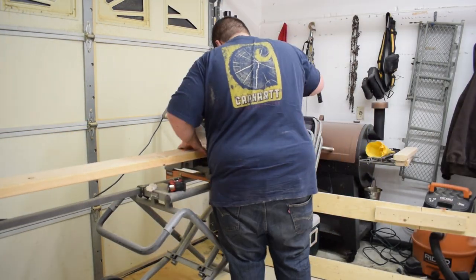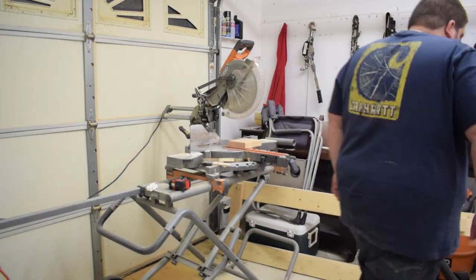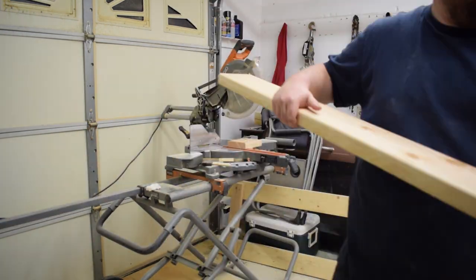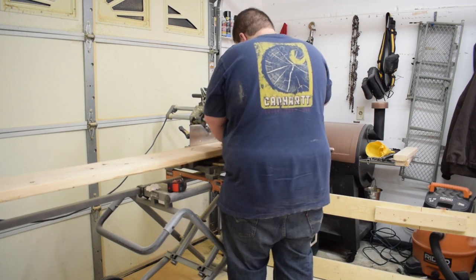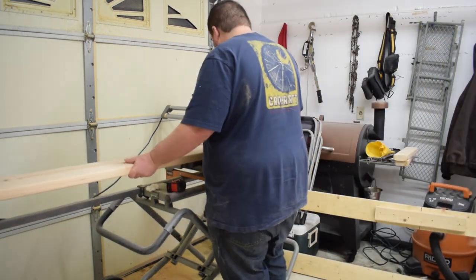Here I am cutting the rails that connect the headboard and footboard. My length of bed or mattress box spring is 76 inches, so that is what I am cutting these at. I'm getting everything prepped so I can put finish on the footboard, the rails, and the top caps that go on both the headboard and footboard at the same time.